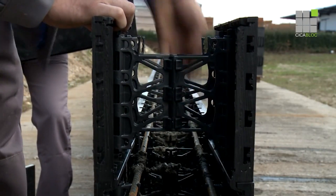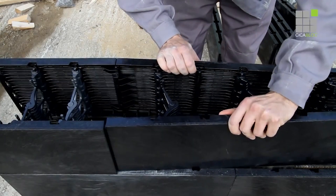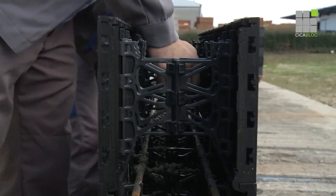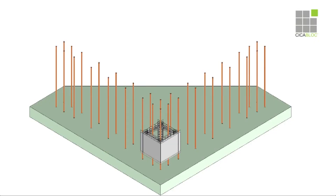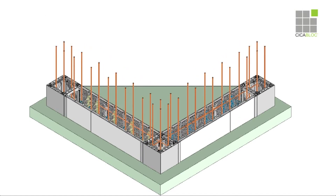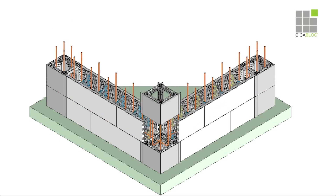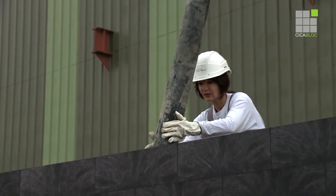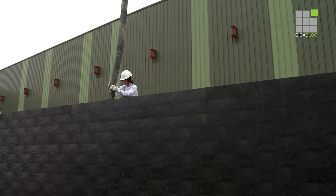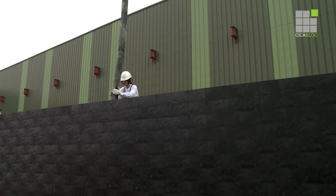Folding hinges make it easy to cut and join things, which will make work much easier. The material won't rot and can stand up to any weather. When you put up a wall, it has a lot of the same qualities as a reinforced concrete wall. The standard block is 24 inches by 8 inches, but other sizes are available. The company says it is great for difficult projects like elevator shafts and retaining walls.